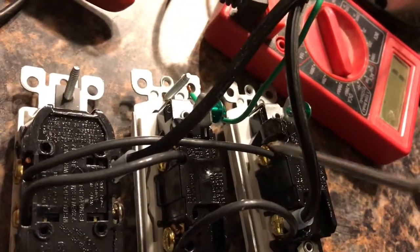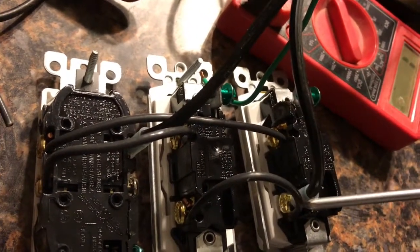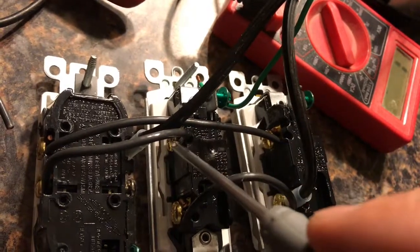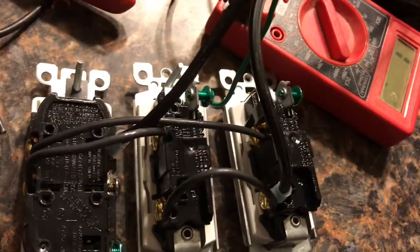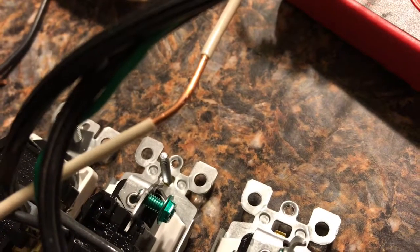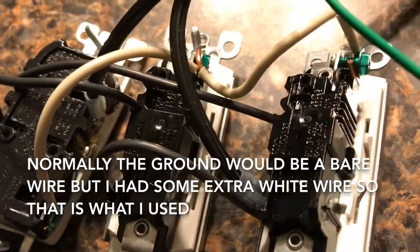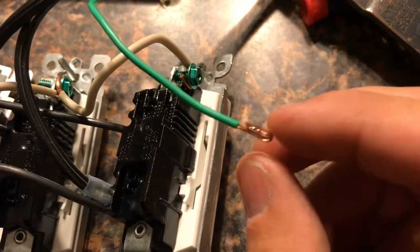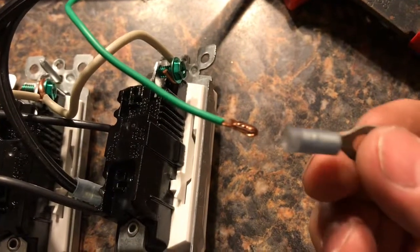The other pole on each switch — which is the supply when you turn the switch on — goes to one side of the outlet where we snapped off that connection, and then the other switch goes to the other side. Main power in, jump power to both switches, and each switch's output pole goes to one side of the outlet. Now for the ground, I stripped an inner piece of wire and wrapped it to make an easy jump to the next one. I jumped grounds from the outlet to the second switch and from the second switch to the first switch. With small wires like this I fold them over, double them up, and twist them together to get a really solid connection.